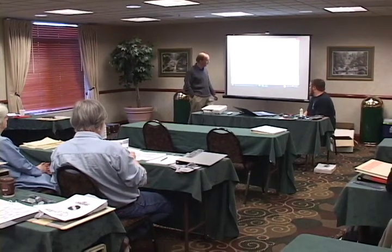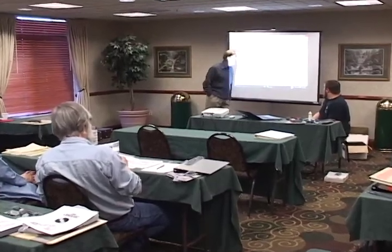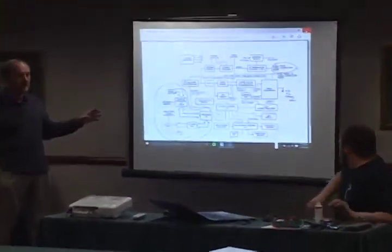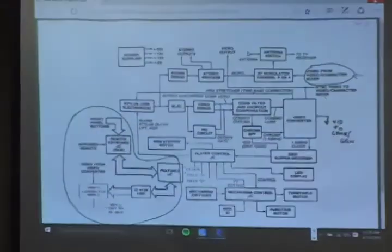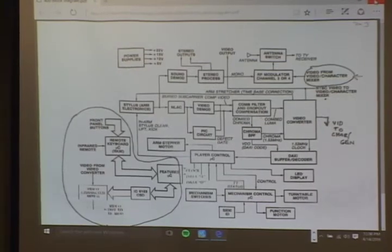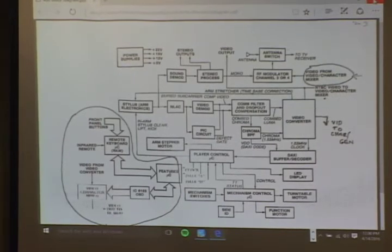One last thing. This is a 1.53 megahertz clock. It's a timing signal that goes through all these CED players. If that clock is missing, the player seems to work, and sometimes you can get a picture, but it's kind of black and white and fuzzy. Certainly if that happens, you need to check to see if that clock signal is present. There's a little coil there that sometimes opens up and the clock signal is missing. You will need an oscilloscope to check this.